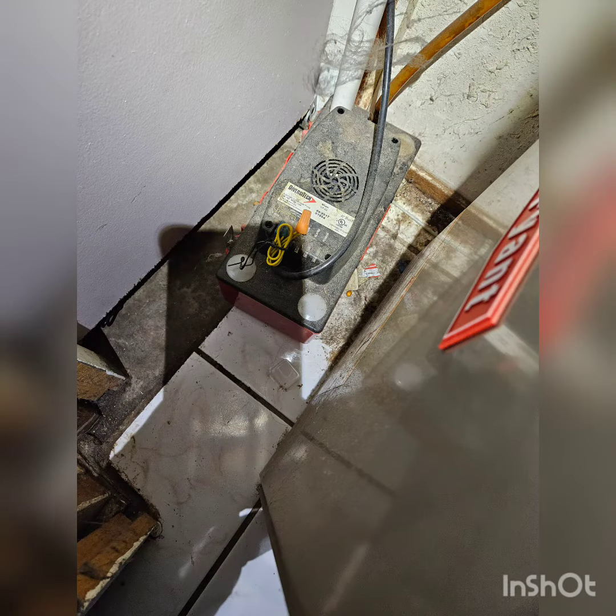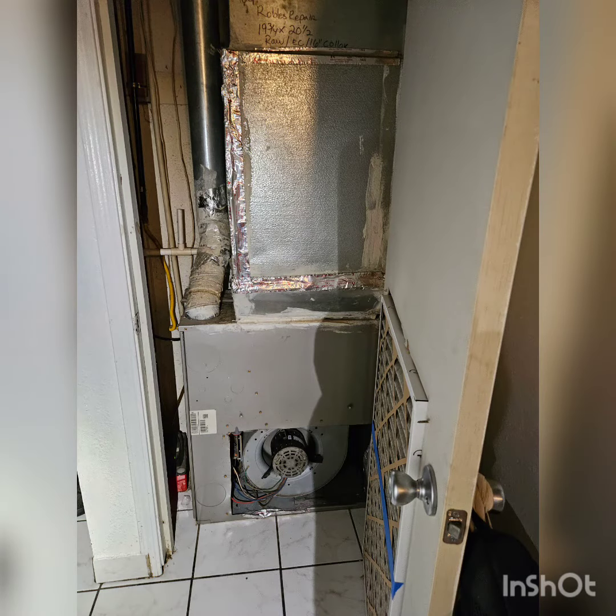My pressures are 50 and 173 — the condenser is still wet. The reason the indoor coils are freezing: look at the bottom — that's a drain pump, the red one, and it shoots the drain water up to the ceiling and from there it goes out to drain. My suction line and liquid line look good from this side, but outside they look really, really horrible.